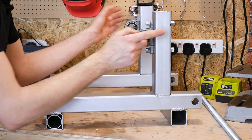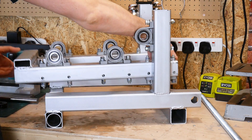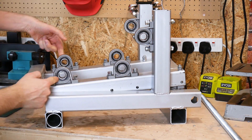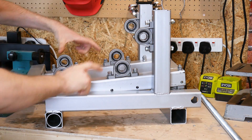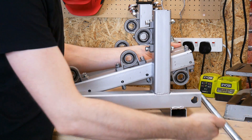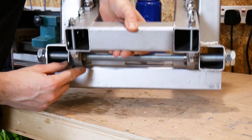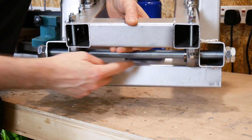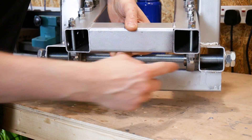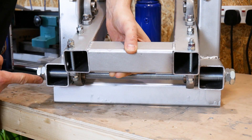Here's the base — these pieces are for one of the rollers and this piece goes in here. These are for rollers which go up here when it pivots, and there are some extra bearings at the back that are going to make the main pivot point for this assembly that goes through that hole there. The bearing blocks have little set screws so I can do them up against the studding, and I don't need any spacers — it should all stay in the middle, with two nuts on each end done up against each other.